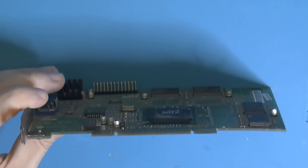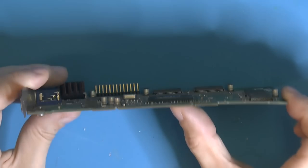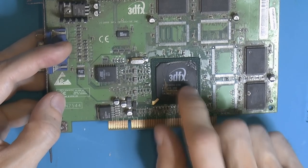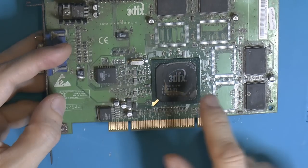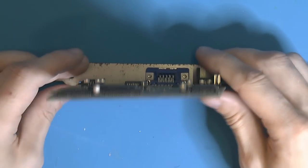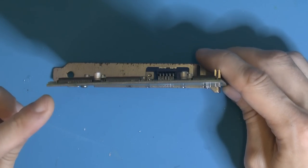But what I think has happened is there is the GPU. I think it's flexed there. It probably cracked solder balls here. Might even be ripped pads. It could be so bad that the chip is a goner, but we don't know. So I guess it's also kind of crooked this way. See, it's too low over here.